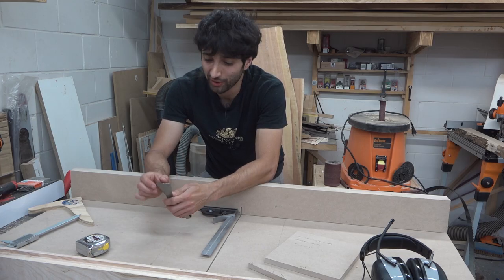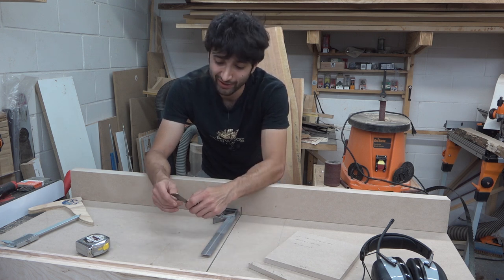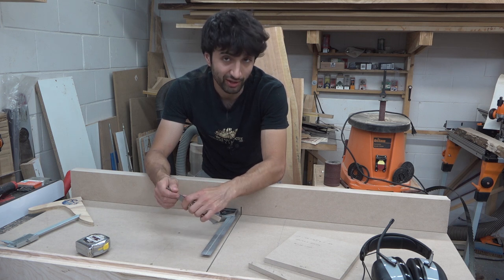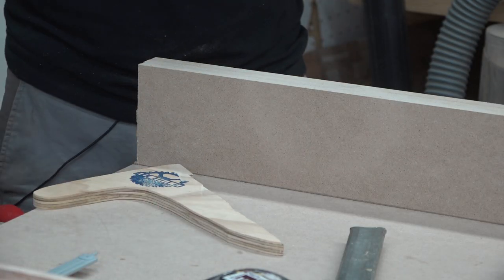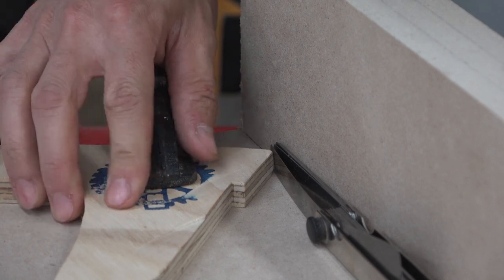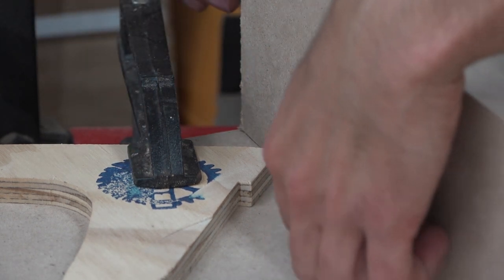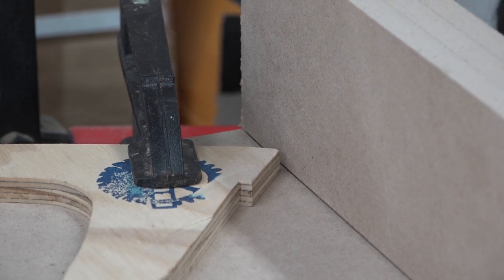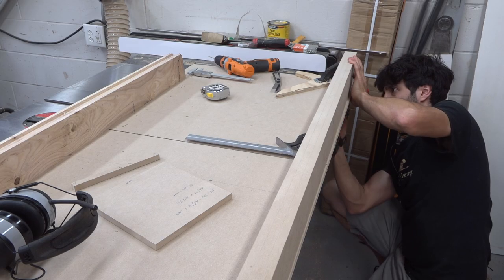So apparently my ability to eyeball square is not quite there yet — that's all right. I have feeler gauges here; I don't have something that thick, so I'll stack a few of them to get to that thickness: .032, .030, .028, and I'll throw in a .007, which should get me pretty close — off by half a thousandth. My screw is right here, so that's where I'll place my adjustment block. I'll put the feeler gauges in there, clamp the block in place, then remove the feeler gauges and the screw, pivot the fence until it touches the push block, drill a new hole, and put a new screw in.